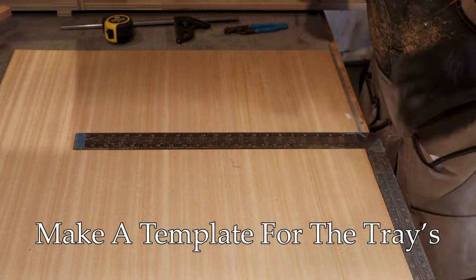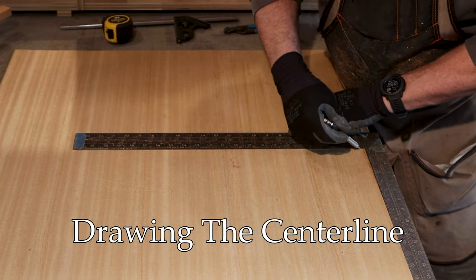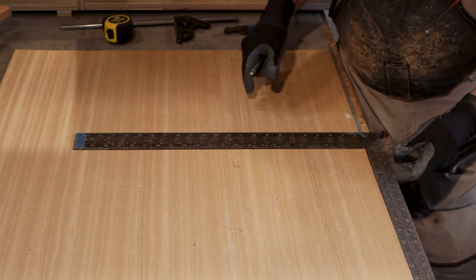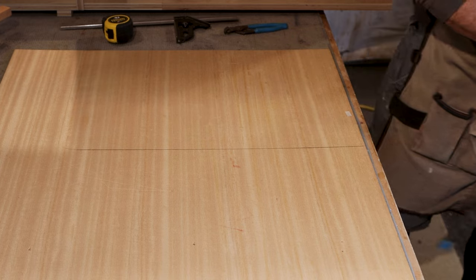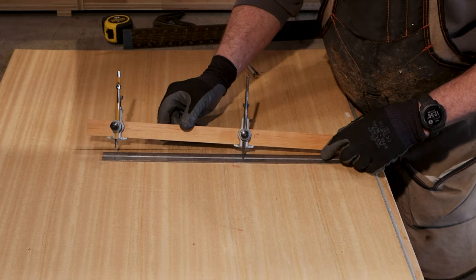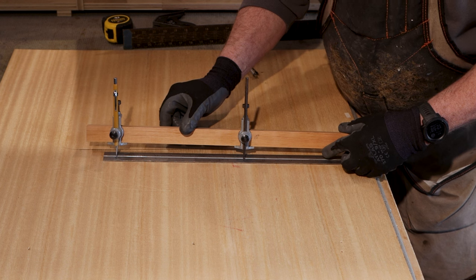So the first thing we do is use our snazzy little pencil here. And we're just gonna draw a line. Our line needs to be bigger than 20 inches because our Lazy Susan's gonna be 19 inches. So we're gonna use the stretch here. And I'm gonna set that on 10.5, and this should hit 1. That'll make a 19 inch radius.